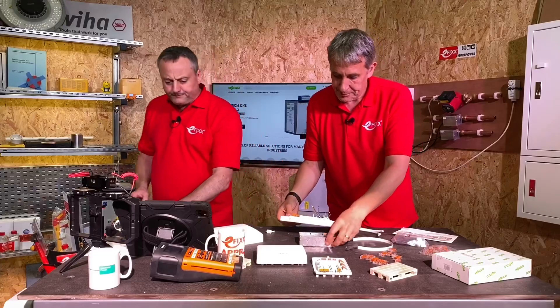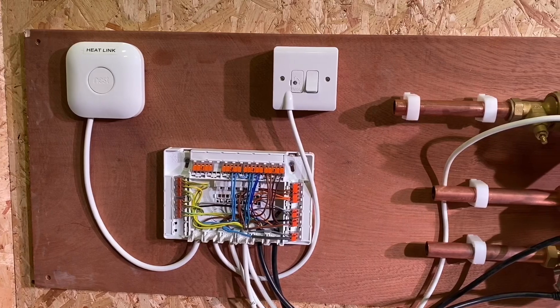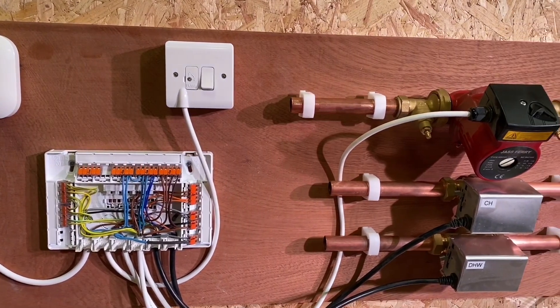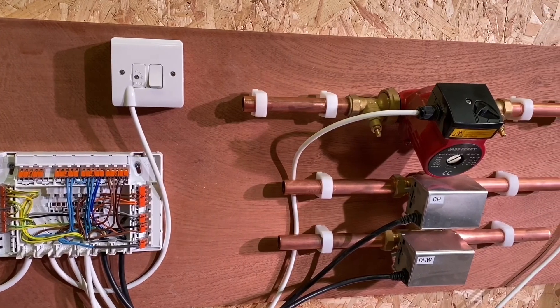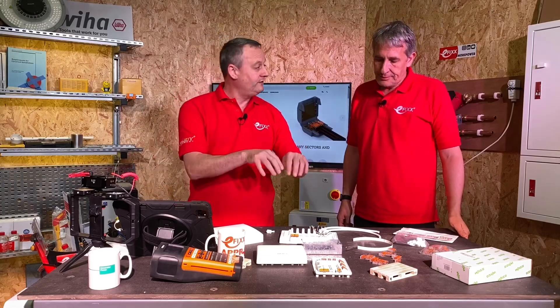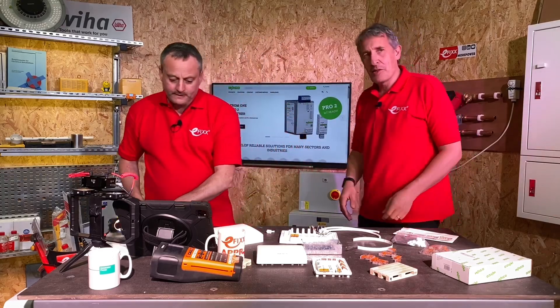I think we can clearly see that in the setup behind us, we've changed nothing else - only swapped over to this new box. What is that snappy number, Gordon? The 2074301. For our American viewers who love a Wago terminal - we can now see loads more space, which is what we wanted. We've got 60 terminals, which is fantastic, and the ability to bring 12 cord grips in as well as entries from the back. It's bigger, which it needed to be, and it solves all the problems.